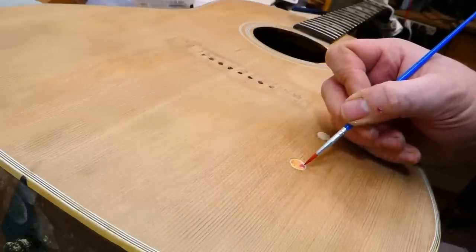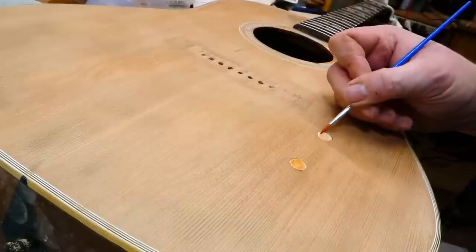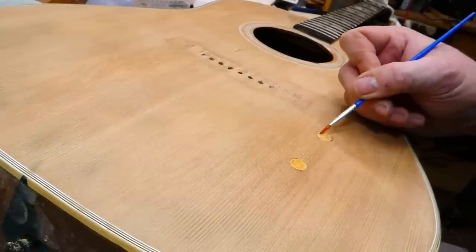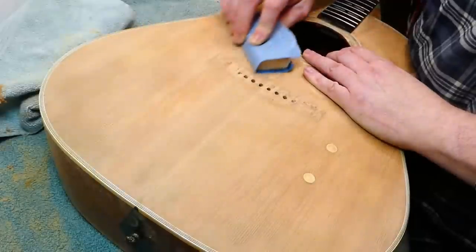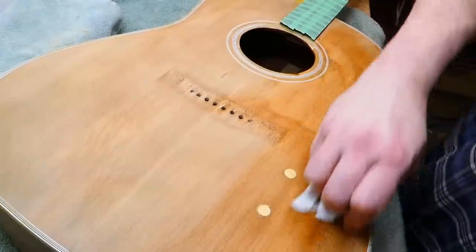The plugs from the pickup controls are glaringly light and I decided to hit them with a dilute solution of potassium permanganate, which can be used to oxidize wood. But the color didn't look like wood that had been under-finished for 80 years — it was just too orange. So I sanded most of it off and I'll try tinting the area again after the initial finish coats go on. Looking at the sanded surface, I could see these undulating little lines — the ghosting from the old finish crackle that telegraphed onto the surface of the wood, oxidizing it only in those areas. One light, last finished-surface sanding, then I'll pat on several coats of de-waxed shellac to act as a barrier coat and give the lacquer something to key onto.